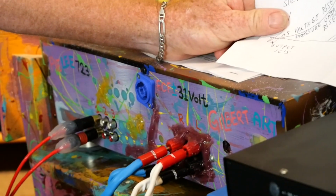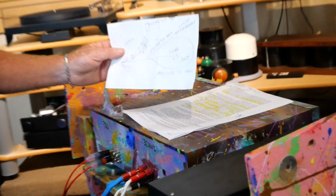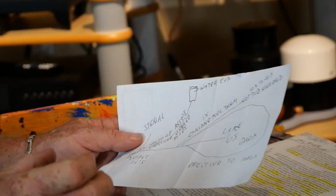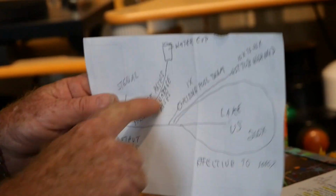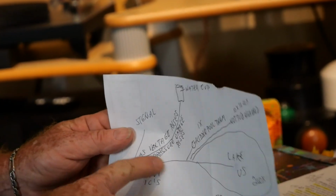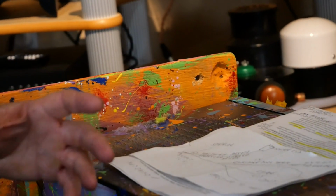So how do we get the energy if we can't just crank up the output transistor? Well, what they usually do is they put capacitors inside, right? And say typically 6,000 to 10,000 microfarads, looks like a C-cell battery inside. There's 2 of them. And those things will sustain music like water coming in from a small little kiddie pool that hit this cup of water coming down from the high voltage. So the higher the voltage you go, the more pressure they have dumping the water in. And then this little kiddie pool sustains our music when we run out, because this only lasts for a split second and depletes. So transformers can only do so much is what they're telling you.